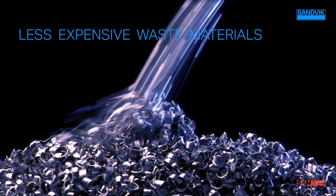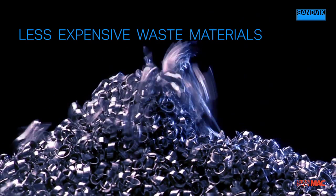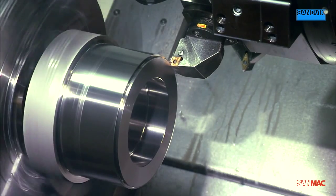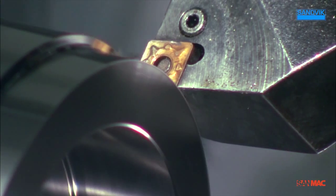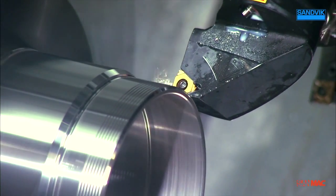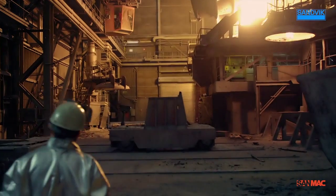When there's no need to drill and bore through the center of a solid bar, there's less machining time and less expensive stainless chips to get rid of. The same weight of raw material can generate twice the number of components compared to solid bar. Hollow Bar also effectively reduces setup time and the number of machining operations.